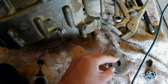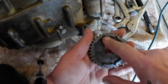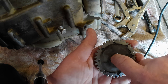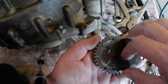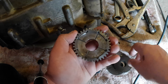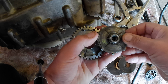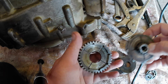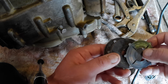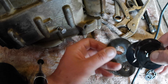So that's your first flat disc — you've got the bushing, and there are your four oil ways. Now flip this over — this is the side that has the ears on it, and again you've got four oil ways in there. With that disc on you can clearly see that the groove goes past the end of the disc to allow oil to come out of the end, so you've got an oil flow through here. Then you've got these discs with the ears on them, with little flutes to allow oil to get in so when it rotates it's lubricated. Double-sided disc, another one of those, and the rear disc with the dimples in it.